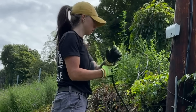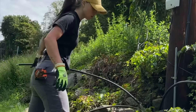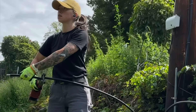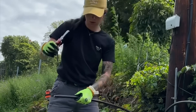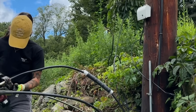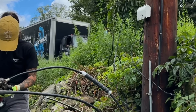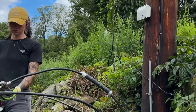The problem is that the customer's house is at least 150 feet away from this pole, and it's an underground service. I really didn't feel it was necessary to charge the customer to rerun that entire run with pipe and new wire. So I gave my inspector a call and asked if I could Burndy crimp and shrink wrap the service wire together and put it back up the pole — and he said that was completely fine.